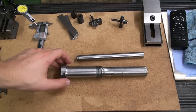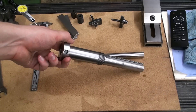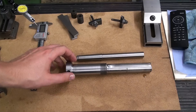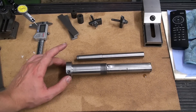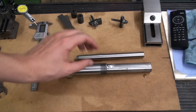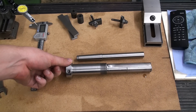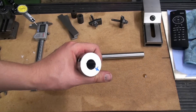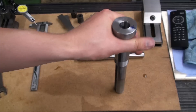Hi, welcome back to the shop. Today we have a repair job. A friend of mine asked me if I could take care of his milling machine spindle. He has a small benchtop, home shop type or semi-professional milling machine, and the Morse Taper 2 spindle on it is a constant problem. The manufacturer doesn't heat treat them very well. They are kind of soft, and when you do heavy milling with the Morse Taper 2 tooling in the spindle, you're clocking up the run out of the Morse Taper. The Morse Taper kind of works or bell mouths the end of the spindle, and that ruins the run out.